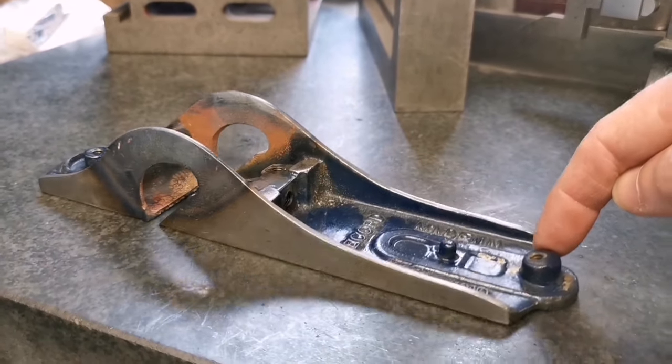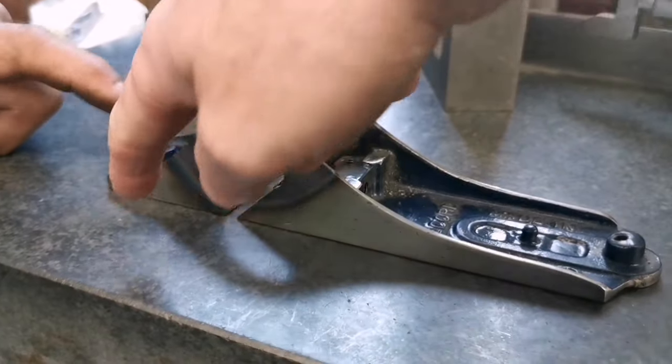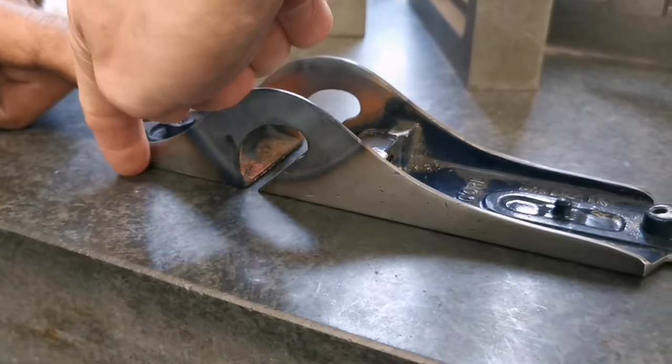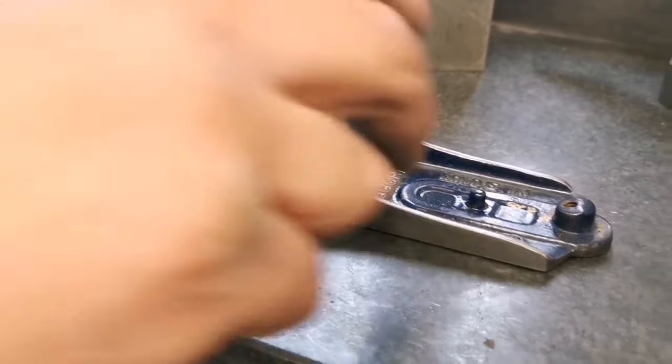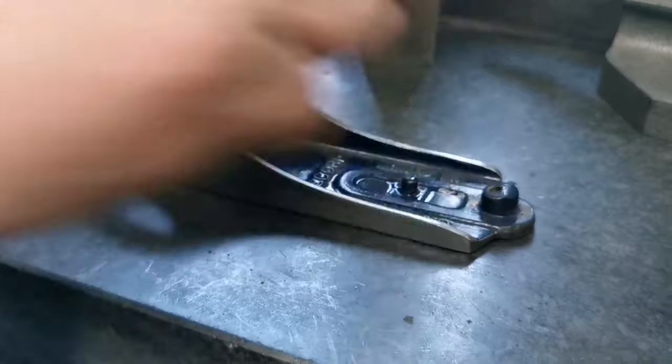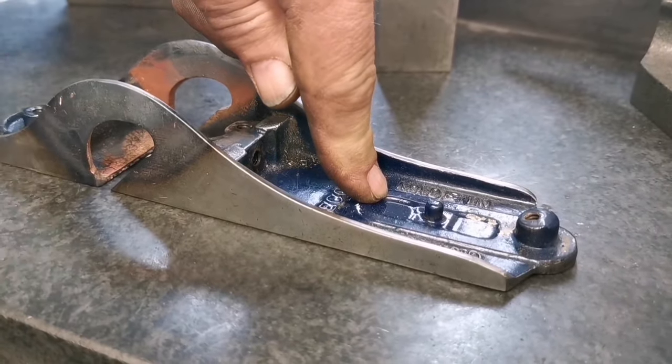That's what I like, the fact that it's at the front now, the front's touching, which means there's a high spot that'll come off with lapping there, which we know is there because that's a low point. That was a twist, but now if you hold that down and tap that, that's pretty well on the plate. Oh, are you listening for it? Okay. You can't hear anything there.